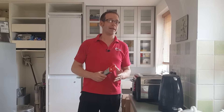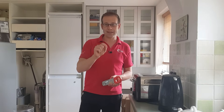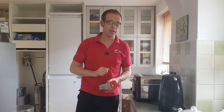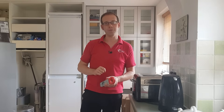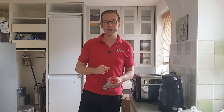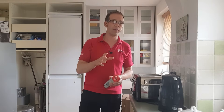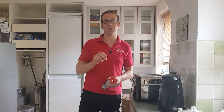But nowadays, we're far more likely, even in domestic settings, to be connecting up equipment that is much more reliant on electronics. And as part of their normal natural operation, these are often designed to leak a little bit of current to earth. In fact, it can damage the equipment if they don't have a good earth connection. Many appliances need to protect their internal control systems from electromagnetic contamination, or EMC, and they'll feature an EMC filter. These use what are called Y capacitors that connect from the live conductors to the protective conductors. It's such a normal part of life with IT equipment that there's a rough rule of thumb that socket outlets feeding IT equipment are normally kept to no more than eight outlets per circuit.